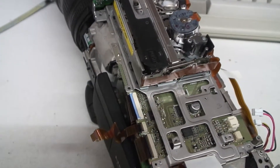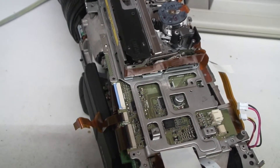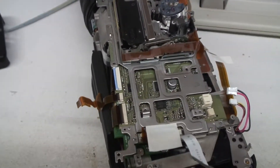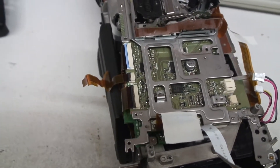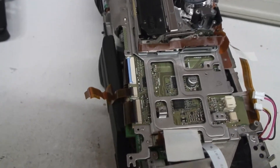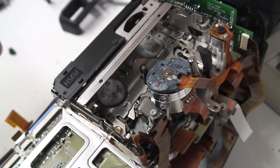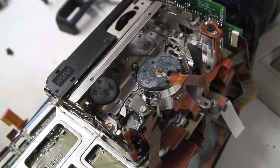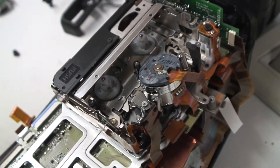I've not done one of this XHA-1, although there are several videos on my YouTube channel that were shot with this. It is a very good camcorder despite it being a good 14 years old and using the outdated HDV format. HDV is a bit of an unreliable format — it uses mini DV tapes, but a small dropout in the tape means you lose about 2 seconds of video, whereas in standard definition DV you would only get a slight glitch in the frame.